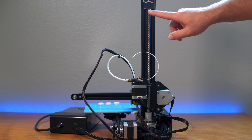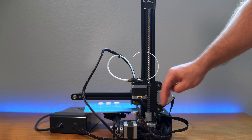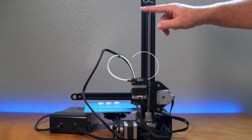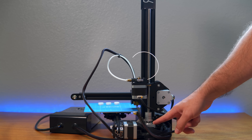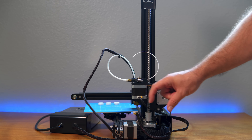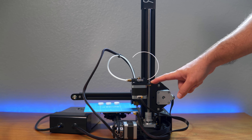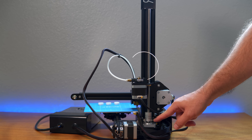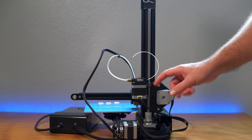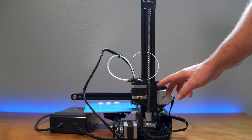That's not the only issue. Not only is this rod being pulled inward on the bottom, it's also offset sideways as well. It's kind of hard to see but if you loosen these two bolts the motor would shift that way. So not only are you going to wear out the stepper motor, the coupler and connector might get wobbly over time. This needs to be addressed early so things don't wear out.